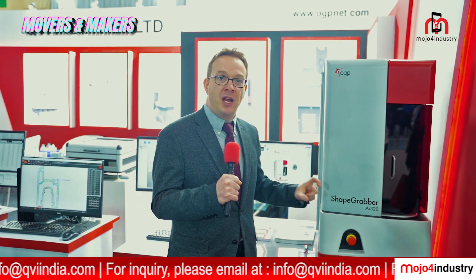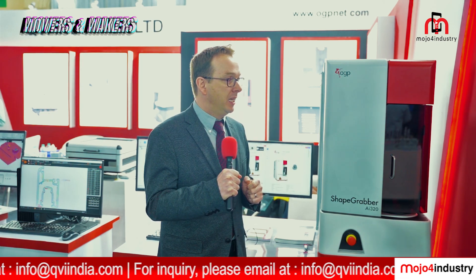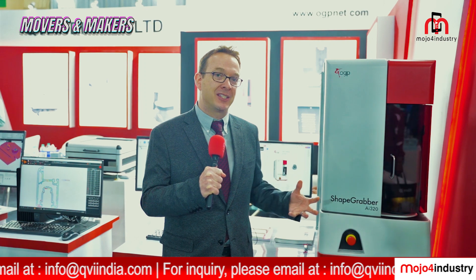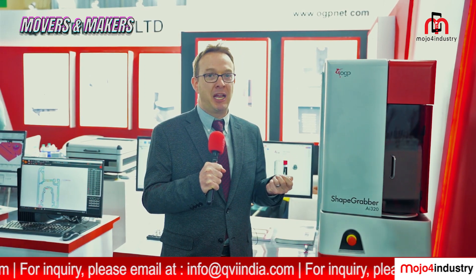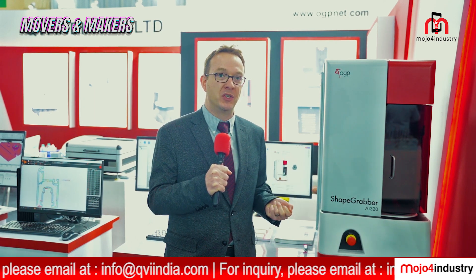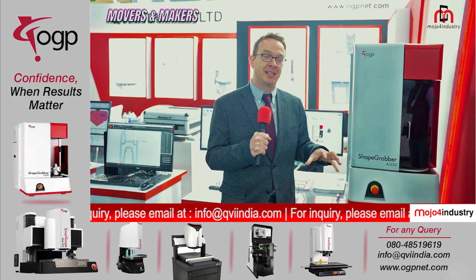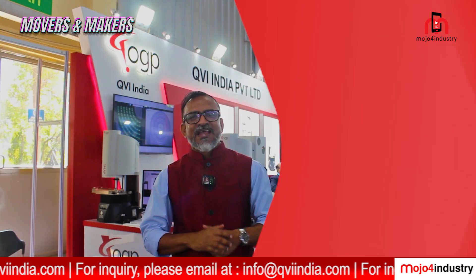Essentially, you can just put a part on there, begin scanning, begin getting your data, and quickly get your results. It's especially suited to manufacturing processes where results are somewhat unpredictable — things like injection molding where you might have warpage and shrinkage, things like casting, metal casting, metal injection molding. There are always effects you can't 100% control for. Another good application is 3D printing — depending on where you print your part in the bed, the settings, and the speed, you can get different results, and all of that can be very quickly characterized with a ShapeGrabber machine.